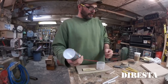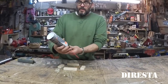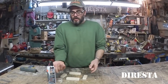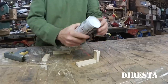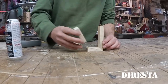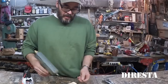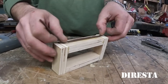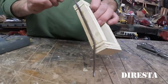Freeze the joint and give it a quick snap if you want to release something. Talking more about this duster: I'm using it upside down and the freon blows out when you hold it upside down. Using this freon to get something cold works really well when you're trying to cool off a hot glue joint that's taking too long to cure. Give it a blast and you can move on to the next part of the job. When you're doing crafting or encasing electronics inside of hot glue and it's taking too long to cure, give it a blast of that freon. A lot of times when I'm running wires inside electronics and I want to keep the wires in a certain spot, I'm waiting for the hot glue to cool off — I just hit it with the propellant and now it's already secured in the spot.